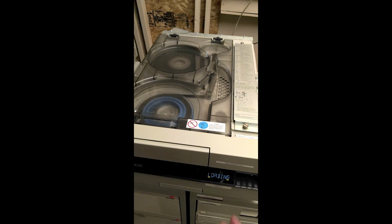It's going to find the beginning of the tape, the BOT mark. We're going to say we want to do a test. I'm going to go through this really quickly here. So we're going to try and run test 101 again. 50, 60, 70, 80, 90, 100. Whoops. Okay, 101, run it once. 6250 for the density. Okay, run it.